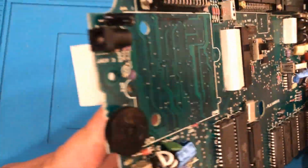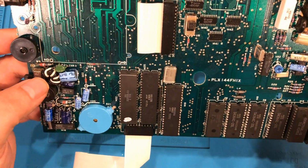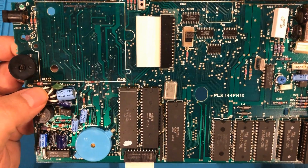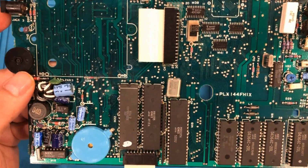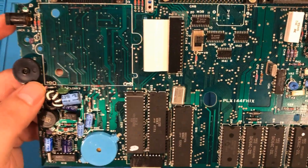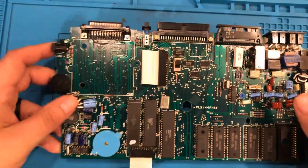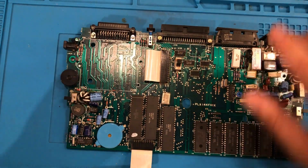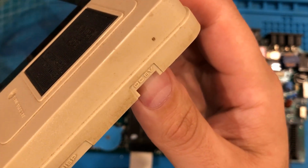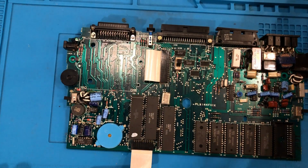Originally I forgot this thing had a barrel jack on it, and it does, but I have a Tandy 1100, and one of the things that surprised me about it is that the barrel jack had the hot on the outside and ground in the middle, and that made me think that maybe when I tested this thing with the power supply, it could have been reverse polarity. It does just say DC 6 volts, but no indication on polarity. So I thought about it.